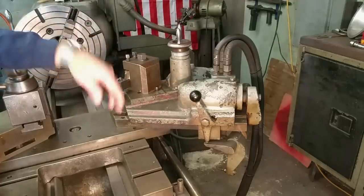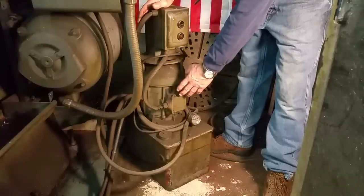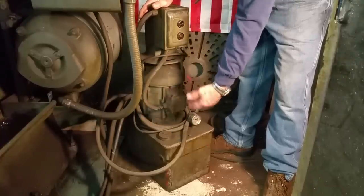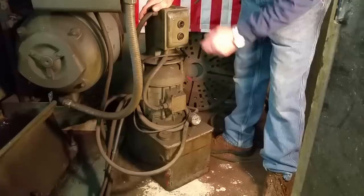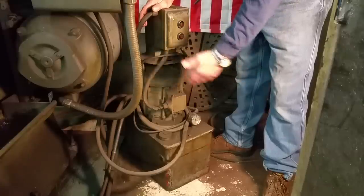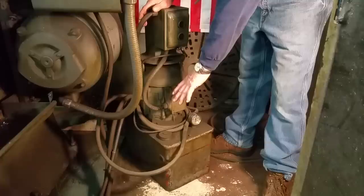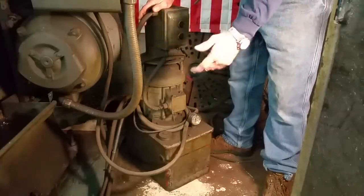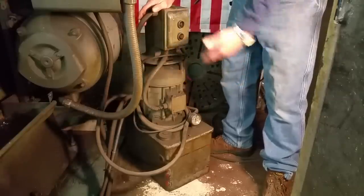Let's fire off the power supply now. This is a pretty simple package. You've got your on and off control, your motor, and your hydraulic pump sitting down in the tank with its pickup — it also has an old metal twist filter in it that you want to service once a year or so. There's a simple gauge here. It never quite goes to zero and it never goes past a certain point when I turn it on — it's been like that since day one. I've completely cleaned it out and cleaned every part of it, so everything inside that hydraulic tank is clean even though it looks rough on the outside. I blow it off once in a while and give it a bath every couple of years.